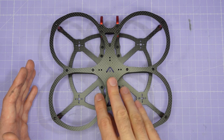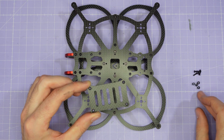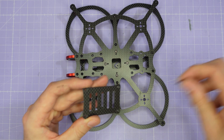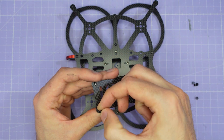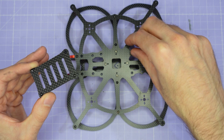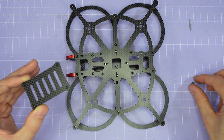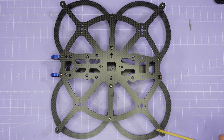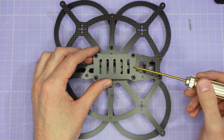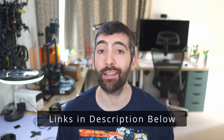Once the prop guards are installed, mount your VTX to the base plate and then install the base plate onto the bottom using medium length M2 screws to complete the build. With that, flip the frame over and install the battery plate on top using the longer M2x8mm screws and M2 spacers that come in the kit. Slot the four countersunk screws through the battery plate, putting the spacers between the battery plate and the press nuts in the top plate to stand it off slightly — this gives you space to install the battery strap underneath. And with that your AOS Cine frame build is complete! For the Cine 35, use M3 countersunk screws and spacers for the battery plate instead of M2, but the assembly process is exactly the same. Check the links in the description for tuning guides, recommended parts, and 3D prints, and until next time — happy flying!